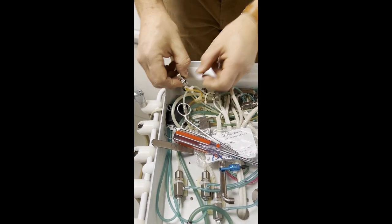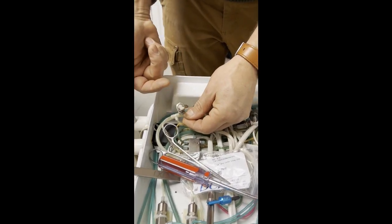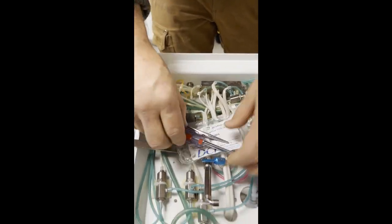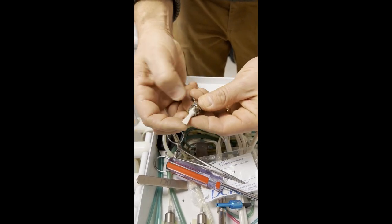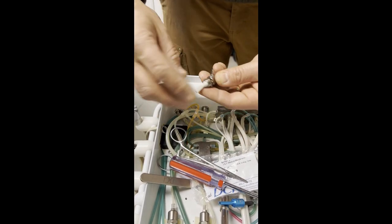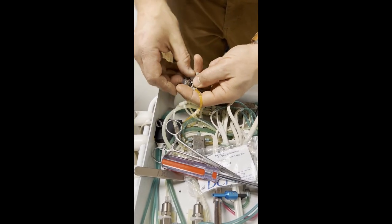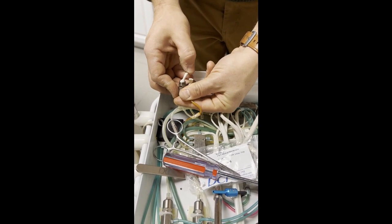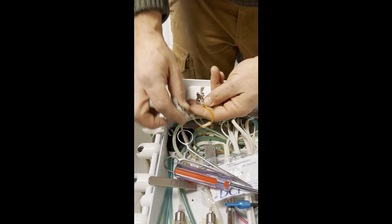So in order to complete this job, we need to make sure that the orientation of the toggle is correct. The old toggle is here, and each toggle has a way that it wants to go. So that toggle falls that way. So we want to make sure that the toggle defaults away from the position that the top pin is. So this one falls up and that one falls down. So that means that this one actually is 180 degrees out.